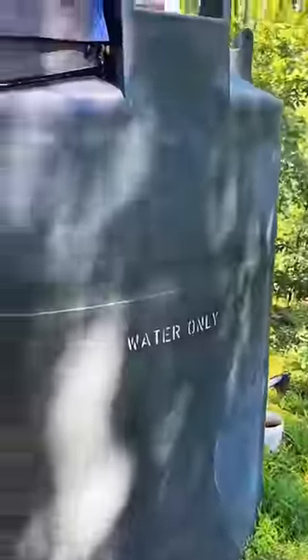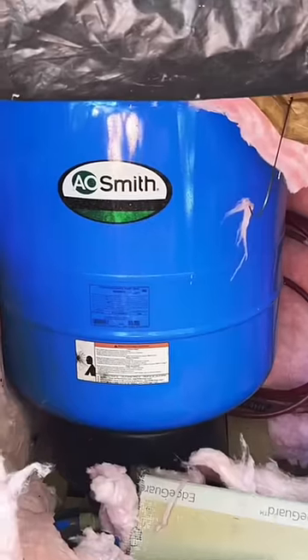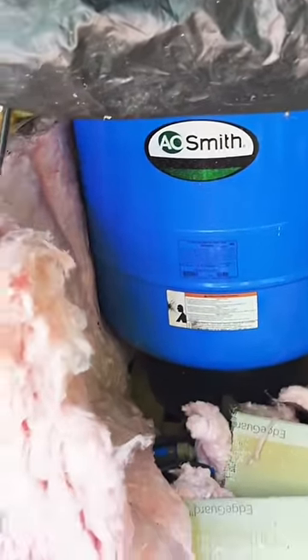The water line I buried is actually a three-quarter line. The pump that pulls out of my rainwater tank is similar to a type of pump you would use in a shallow well, and that feeds right into a big pressure tank. Between there and the faucet at the kitchen sink, there's only one elbow. And even though the distance is far, the pump only has to actually lift about eight feet in elevation. All those factors added together is why my flow and pressure are so high.